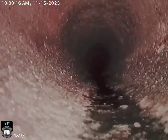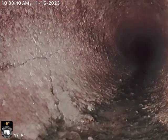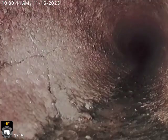Coming up here on another foot, we're going to leave that concrete and switch back into the cast iron right here at this curve. My biggest concern for what I've seen, aside from that little tiny root tail, is this crack right here in this concrete. That concrete's probably 60 years old — it's going to be original from when your home was built. We don't know how recent that crack is, so do you have an idea — is it good for 10 years, for five years? You really can't put a timestamp on it, because it is an etched engraved crack. At any point in time if water sits there, it could break away and lead to a collapsed pipe, because you can see after the little triangle wedge right here it's starting to crack and go further down. That can lead to a domino effect of causing multiple cracks in the system. That's my biggest concern.